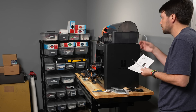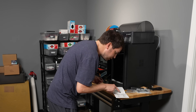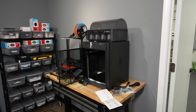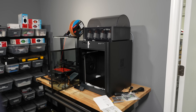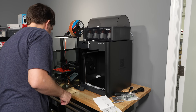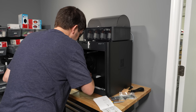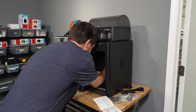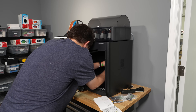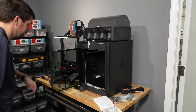Spool holder assembly — I thought that's the whole point of this thing. Hotbed unlock — that sounds mildly important. Unscrew three screws — they all have little orange markers on them. This poor little Ender over here is like, 'Oh I'm being replaced.' No you're not. This screw is in a really annoying spot. This is a core XY design, which is different from the Ender — the Ender is called a bed slinger, it shoots the bed forwards and backwards for the Y-axis movement.